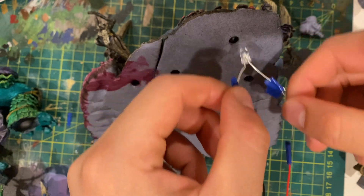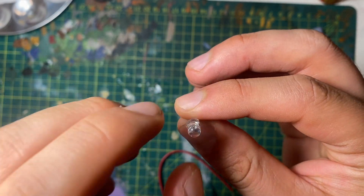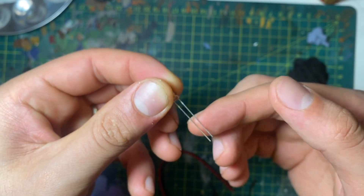Initially I used electrical tape but it was very inconsistent — it couldn't hold the wires together so the light would flicker on and off. I wanted something more reliable, so I bought a soldering kit for $20. I put the resistor on the positive side of the circuit. On the battery connector, positive is the red wire. On the LED there is a flat side — that flat side goes to the negative side, so you use the pin on the opposite side for positive. I linked from the battery connector positive to LED positive, and negative to negative.